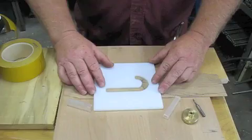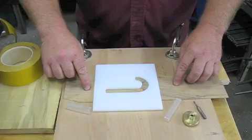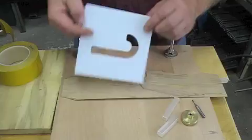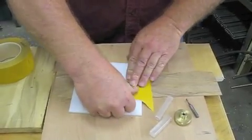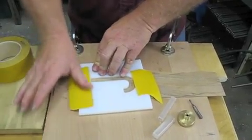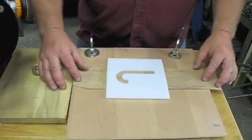I'm going to just cut this out right here. The key is you have to secure this template onto this piece, and I'm just going to use double-sided tape. Then we're going to secure this piece to the wood. I have my template secured to the veneer so it's not going to move around when I'm following with the router.